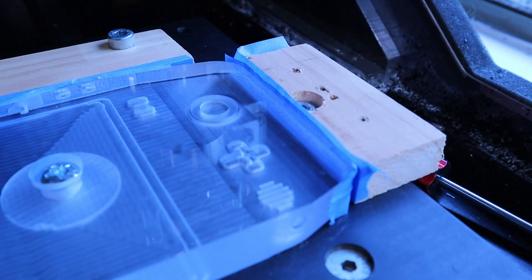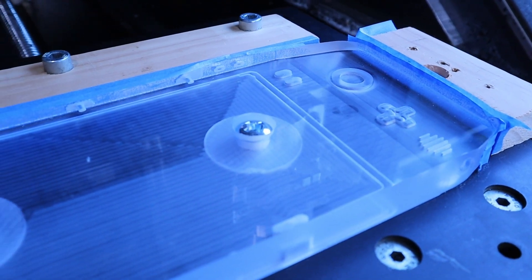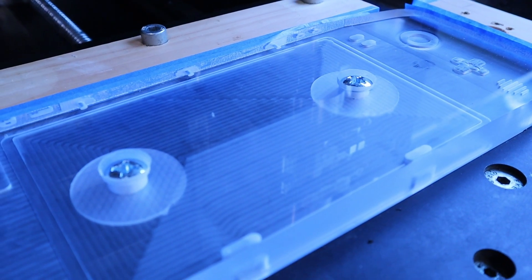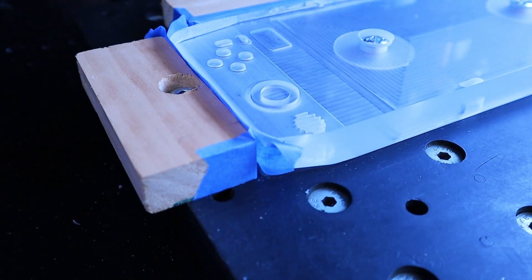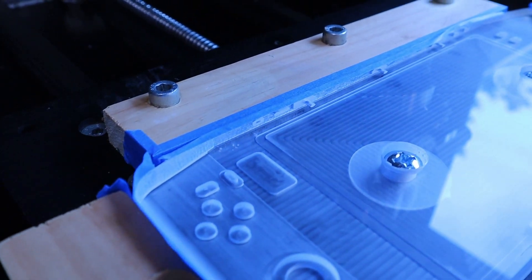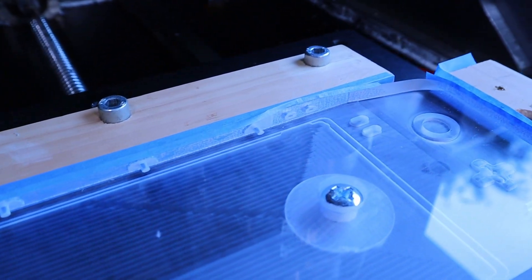I repeated this process for the bottom of the housing and then moved on to the inside. I flipped the stock face down and used the dial indicator to align it to the machine as closely as possible. I set the origin for this side of the job to the middle of the stock in the X and Y axes so I could touch off both sides of the stock and halve the difference to hopefully correct for the small amount of run out my machine has in its spindle. I cut some pieces of scrap pine and applied a layer of masking tape to both the stock and the pine before using superglue to glue the parts together. I was then able to bolt the pine down to the machine plate for extra support on the thin edges of the case to help reduce vibrations and keep the job in the correct position. The machine will hit these supports while it machines the inside of the housing, but that's okay as the pine is soft and the machine will have no trouble cutting through it.